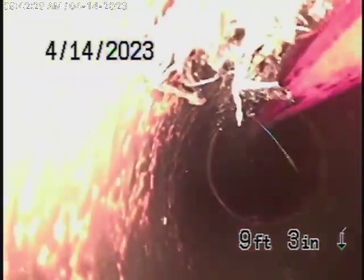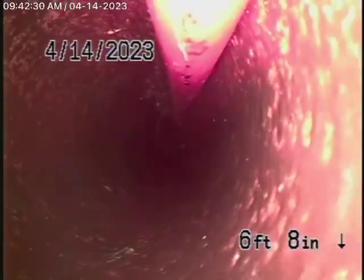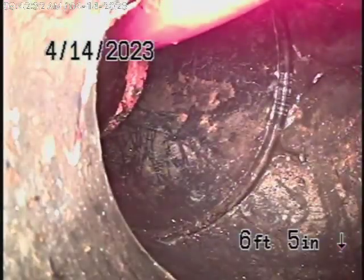When I go in again I will clean out those roots to make sure the line is clean. This all should have been replaced. There are very heavy roots here as well — this almost looks like it could be Orangeburg pipe. I'm going to clean it all out anyway. I just wanted to make a video of the line condition, and we'll go ahead and stop the recording.